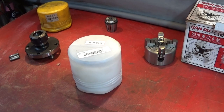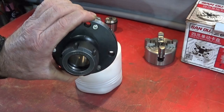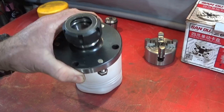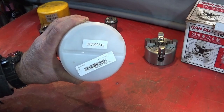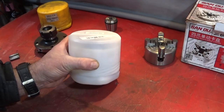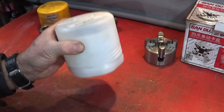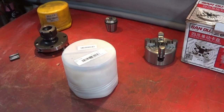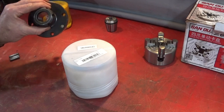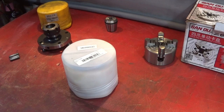I've just bought some new equipment for the Chinese Mini Lathe. I did have an ER32 collet chuck for the Chinese Mini Lathe and that was really good. But I've recently seen on Banggood that they do the ER40, and I have a full set of ER40 collets, so I thought it'd be wise to buy this one. Plus it's much bigger than the ER32 and obviously takes larger diameter bar.